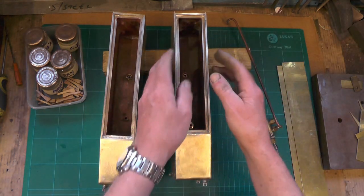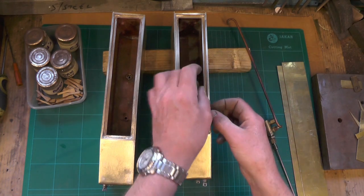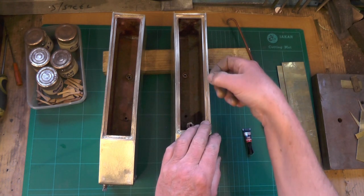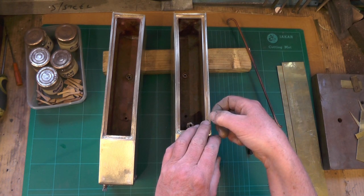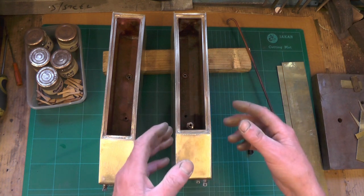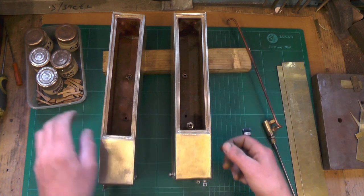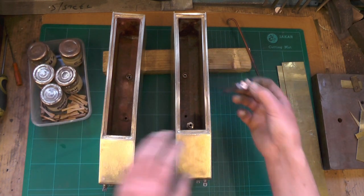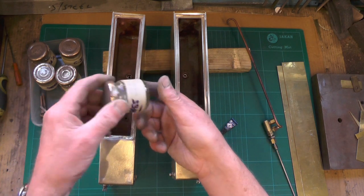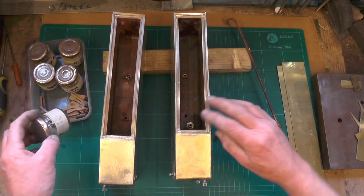When you're soldering anything like this that's subject to any slight distortion, where I've soldered my angle onto my side of my tank, if I've got any slight gaps with the cooling and the expansion etc., I just put a bit of Loctite in and then I save all my brass dust and filings and just sprinkle a bit in, and when it goes off just file it off - and you can't tell.